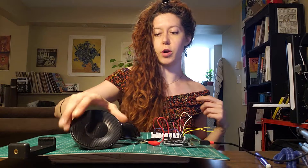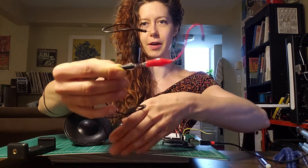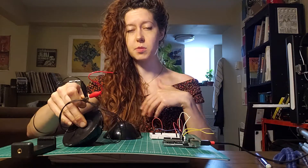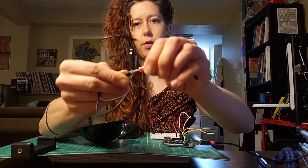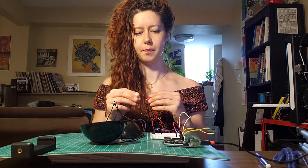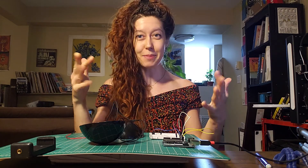All you need is an Arduino Uno, a speaker, some alligator clips. The ground connection is the one closest to the plug. With your speakers there are going to be two sections — one section is for one speaker, the other section is for the other speaker. So right now I'm only playing out of this speaker. But if I were to move this red alligator clip from the end section to the middle section — the sections are separated by black lines — then I would be playing it out of the other speaker. I'll get this written up as a project tutorial at some point in the near future. Please let me know if you have any questions, and happy exploring!